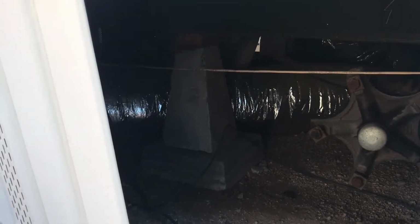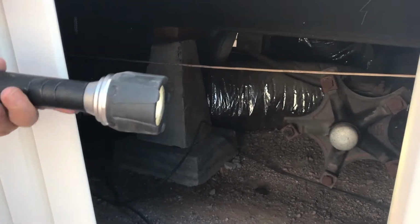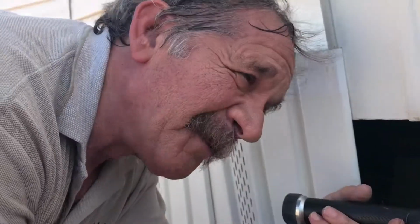Okay. And I do have another thing. The pressure relief line for the water heater is actually going in the crawl space. And if that pressure relief line leaks, you're getting moisture underneath the house. It is a relatively easy fix. The line comes down about 6 inches. Take an elbow and just cut a hole through the skirting and pop it outside. Okay.